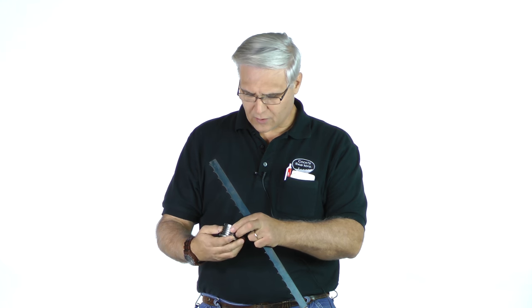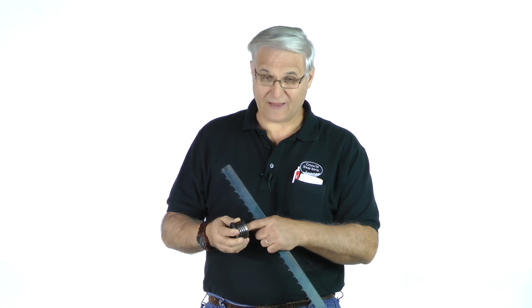This roller guide is turning, and we've talked about feet per minute. If you're turning in the 5,000 feet range, the barrel of this roller guide, as we call it, is about 2 inches. Well, that's spinning at almost 10,000 RPM. Everything about these blades and roller guides is really going fast. So we have to have small bearings in here for this to spin on, and that's a lot of speed in there. That's why we like the re-greasable bearings.